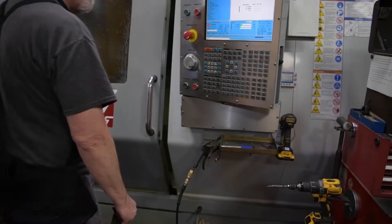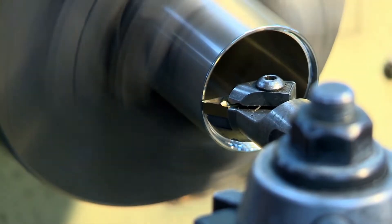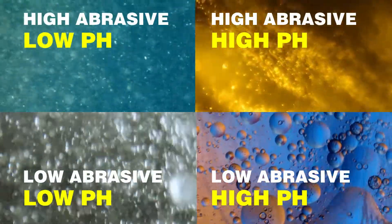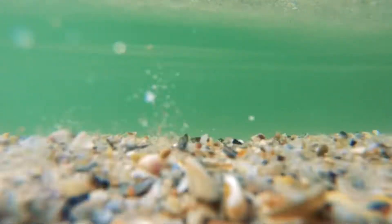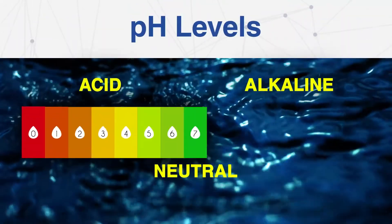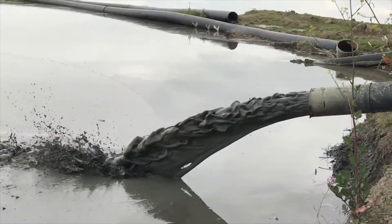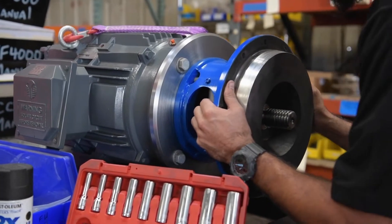To find what type of material the pump should be made of, you need to look at the abrasiveness and pH level of the material and fluid. Is it abrasive? Then a high chrome pump. What is the pH level? pH is the corrosion or acidity of the liquid — the pump may need to be stainless steel.